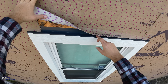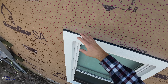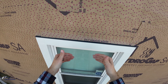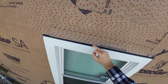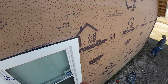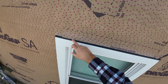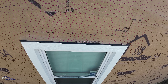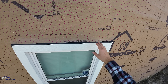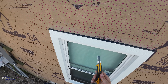The best thing you can do — what we do on all of our installations — is set our nail guns to where it drives the nail slightly proud of the material, and then go back and tap each nail with a hammer. That might sound like a lot of work, but it actually takes a lot longer to come back and seal up overdriven fasteners with caulk. Generally you can set the nail depth along with the pressure on your compressor to where it sets the nail head flush or slightly proud.